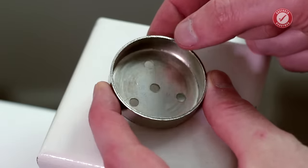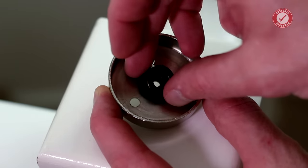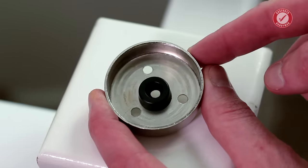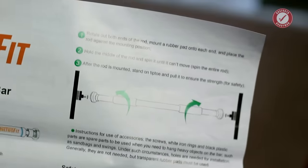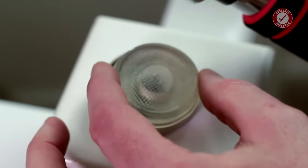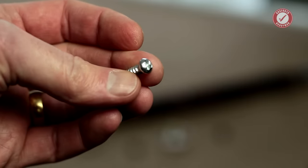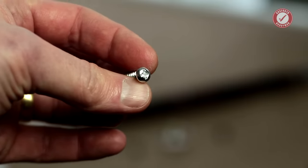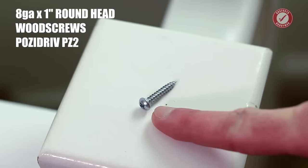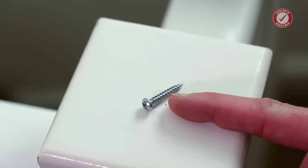So these are the brackets that come with it — you can see they're really straightforward, basically just four screws: three around the outside and one in the middle. I'm assuming the middle screw goes through this little kind of bush thing. The instructions don't match up to what this looks like, which is no huge surprise, but I'm just going to work it out. You can see on the end of the pull-up bar itself it's got this kind of rubber inset washer-type thing, and I'm assuming that's going to go over the top of that and kind of lock itself in place. As per usual the screws that came with it are awful Phillips things — really poor quality, very lightweight — so they're going straight in the bin. Instead I'm going to use some 8-gauge by 1-inch round-head wood screws with a Pozi drive head. These happen to be Quick Silver screws from Screwfix — use whatever decent brand you want.